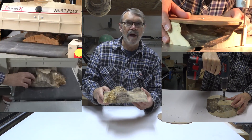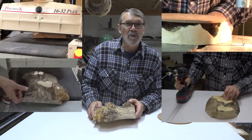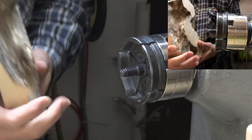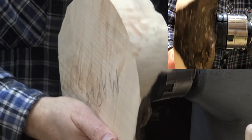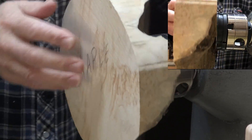I don't know if I can get a nice little platter out of this or a real shallow bowl, but I'm going to see what I can do. These two flat spots will be enough for my jaws on my chuck to sit firmly and safely against. All right, that seems to be running fairly true.